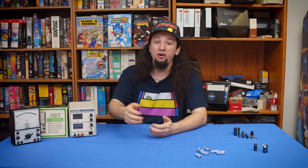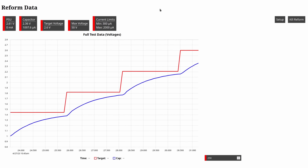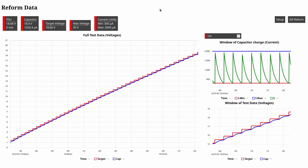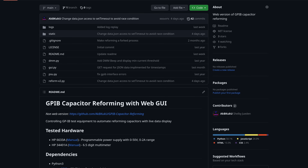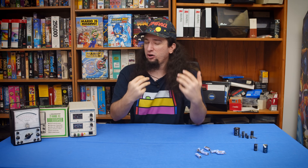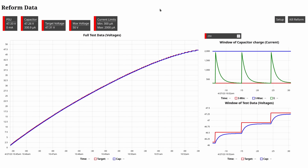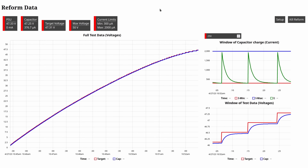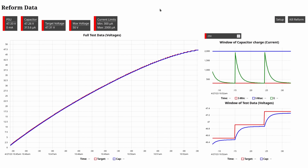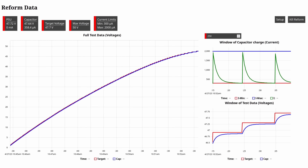Using this software, I can not only have the voltages automatically increase when needed, but I can better understand what is happening by seeing the history of it. These values are even logged, which lets me open them in a spreadsheet program and chart them to see how it worked in action. That gave me another idea, and I coded a whole web frontend for this with real-time plotting. Both the web version and the CLI versions of the software are available on GitHub as open source, MIT licensed. They are currently programmed for the interface language for the test equipment I have, but it wouldn't take much work to adapt them. The software performs the exact same processes I've been going over — when the current dips below the minimum, the target voltage is adjusted up and the current shoots up with it, but never beyond the maximum allowed values.